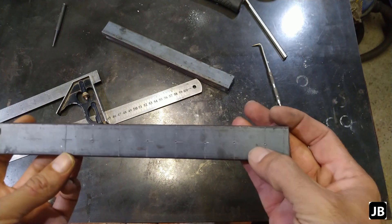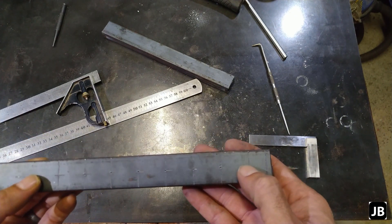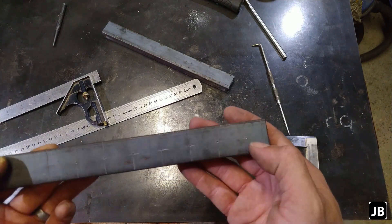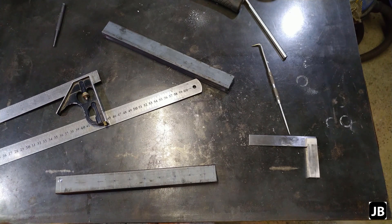Now that we've got them all measured and punched — I left those two open, this is going to be the back end of it. What we're going to do is spot-drill them with a center drill, then start with a smaller diameter, something like a 5mm stubby that we'll use, and then go up to the biggest one I've got which is a 12.5mm. I want to use a 12mm through bar so I'll have to get a drill, since the biggest one I've got is a 12.5 and it's going to overdrill in any case — but we can start with the step drilling.